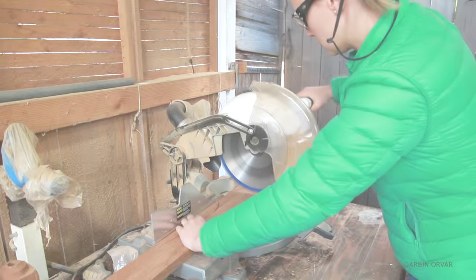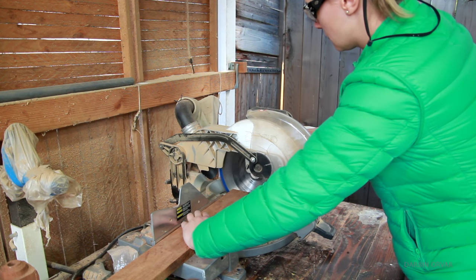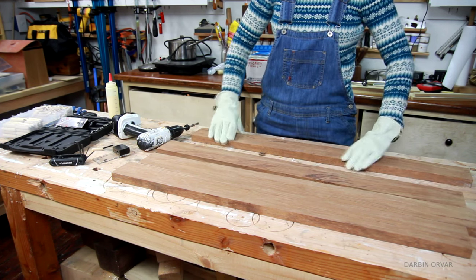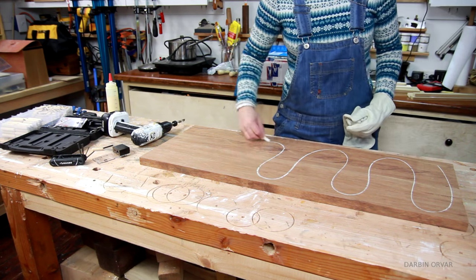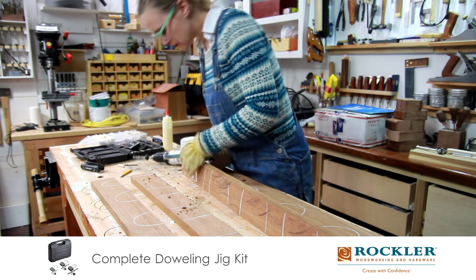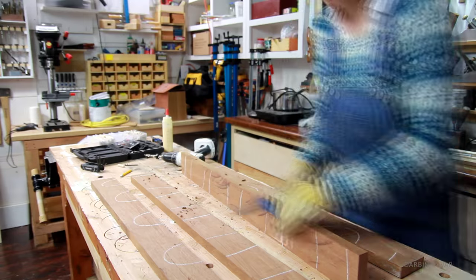I started with the top. I had some extra EP that I had cut up for the media stand counter, so cutting those down a little bit, and then I went inside the shop to glue up the counter. The sides here are quite a bit smaller than the other counter I made, so it was very manageable to put together. Drawing the lines to remind myself which side is up, marking out where the dowels need to go, and then using the doweling jig to drill holes. I figured three dowel holes across the piece should be plenty, so just going down the line on each board.